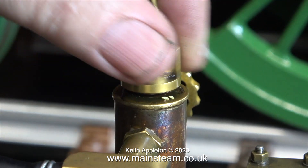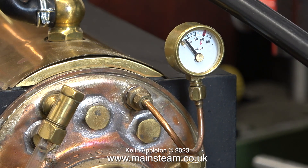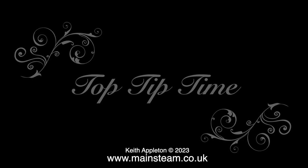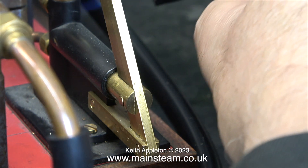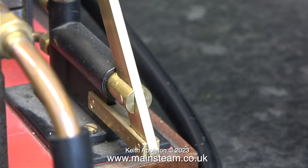After about 20 minutes, some pressure appeared on the pressure gauge. I immediately noticed the usual problem - the hand pump fitted to this little plant is stuck. This is usually due to the inlet ball being stuck on the seat, owing to the residue in the water drying out whilst it's been in storage. And now it's top tip time. Here is a very simple fix if your balls get stuck: use a small blow torch to apply some localised heat to the valve chamber. I'm using this very small blow torch just to warm the pump up, particularly around the valve chamber area, and immediately the ball frees itself and now the pump works once again.